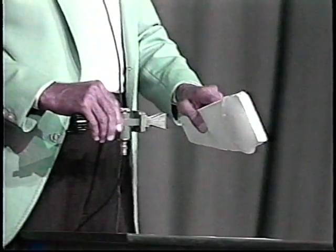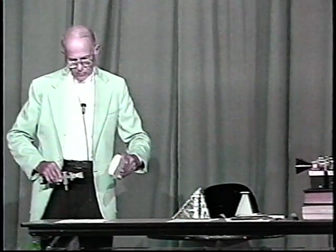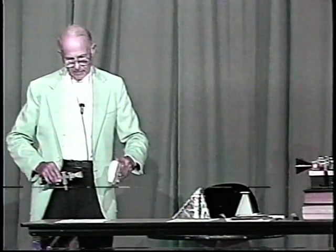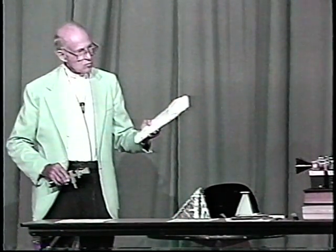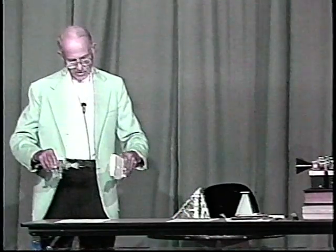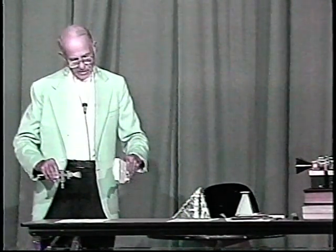I'm having a little trouble focusing it. But you notice that I was turning it a lot this way. That's an interesting thing about lens antennas — the alignment is not critical at all. You can be sloppy as hell how you set these lenses up, and they work fine.